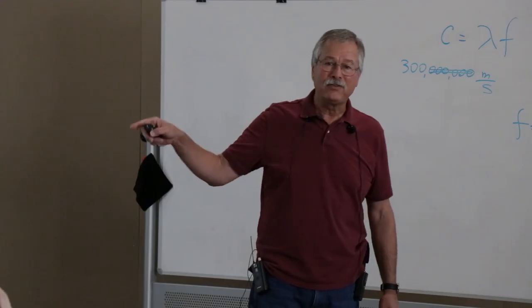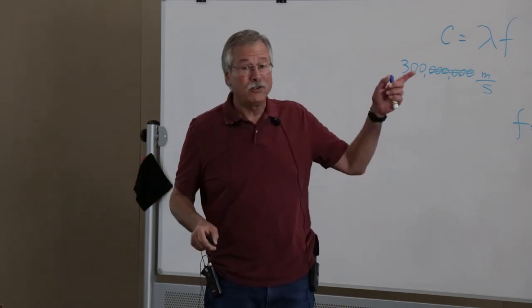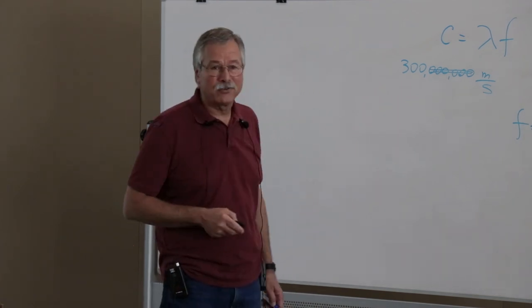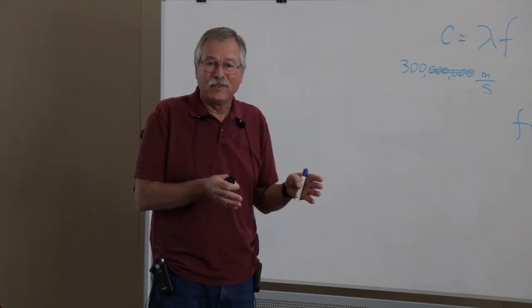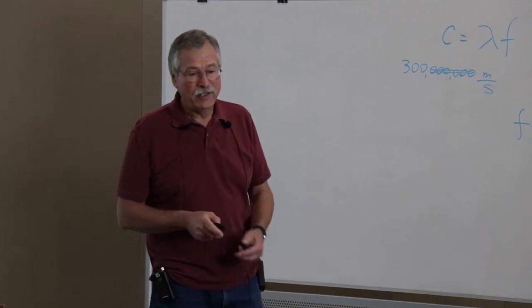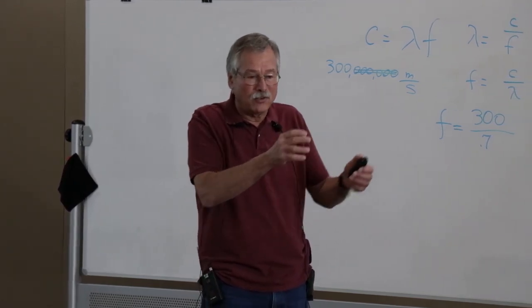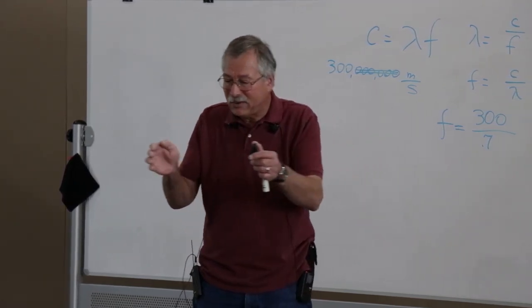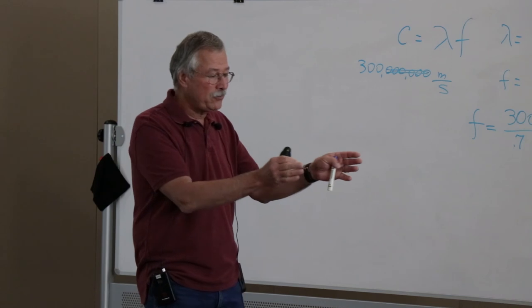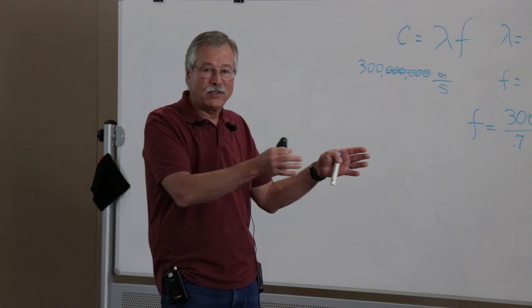But guess what? At the receiving end, if that receiver has an ordinary AM detector in it, he doesn't hear you very well. It's going to be all distorted. So what the radio has to do is restore the other sideband. But because it's symmetrical, it's doable with circuitry. That's why when you hear a ham tuning an HF radio up and down the band, you'll hear Donald Duck type speech. As you tune across it, the speech becomes more and more intelligible, and less as you tune away from him. Your radio is restoring the other sideband, but you keep moving the frequency with your tuning dial, so the signal will become intelligible and then less as you go up and down.